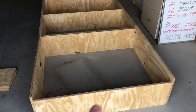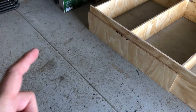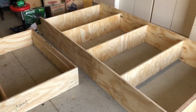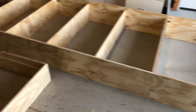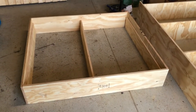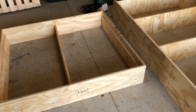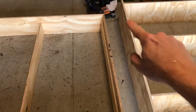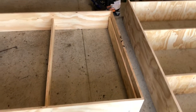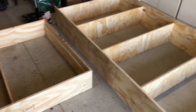Now that I've attached the one metre extension, I'm going to come down and work on the lower putting green on this end. Because the main part of the mini golf course is quite long at 3.4 metres, adding an extra piece on the other side at 1.4 metres is quite big, so I've decided to make it into two sections. I'll put some coupling plates on the side so I can detach it later, store it separately, and it'll also make it easier to move around.